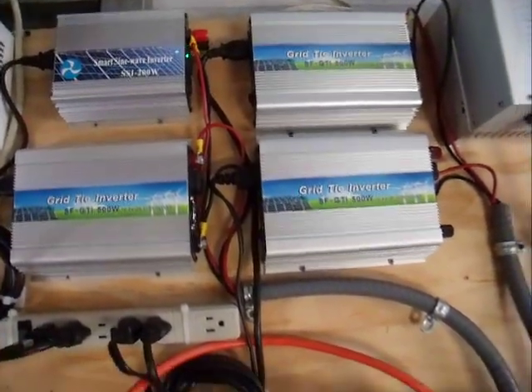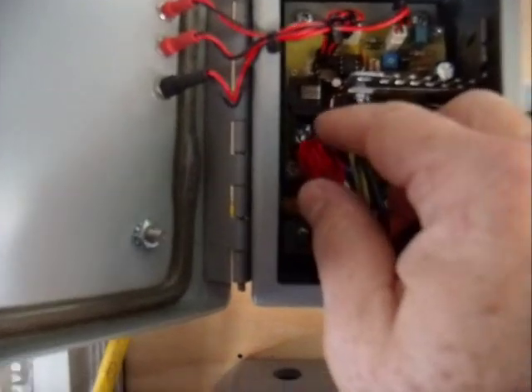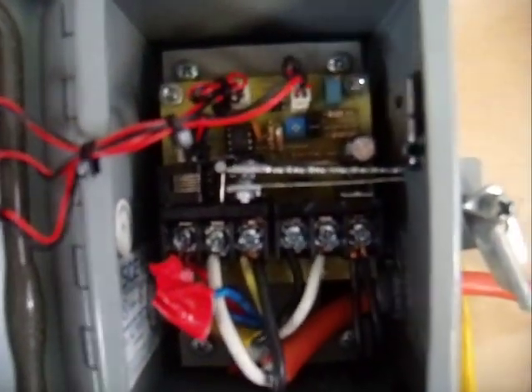I just thought I would share that with you all. It does take a little bit of rewiring in their system. I ended up having to play with it and look at their diagram. You'll see that there's two blue wires going to the second from the left connection, and the two wires going to the coil to energize the positive and negative come from the second from the left, which is the positive, and the third one from the left, which is the negative. Connect those two to the relay — boom, you've got power. To disconnect the relays around the back you really don't need any other wires, so I just disconnected the two blue wires because I could hear the relays in the back energizing and clicking. Once I took that off it worked fine. Once I get done here, I'm going to take those two blue wires and the two yellow wires, and the PCB board will take care of it from then on, and I'll be totally automated at that point.